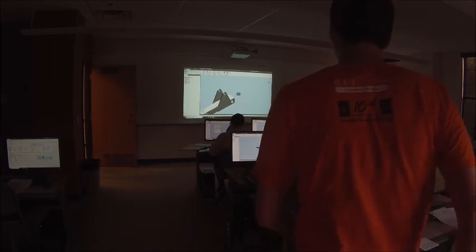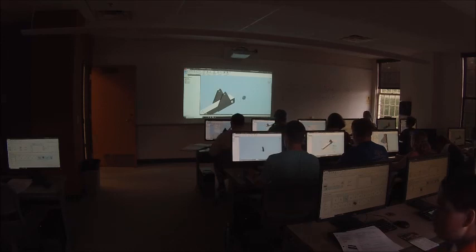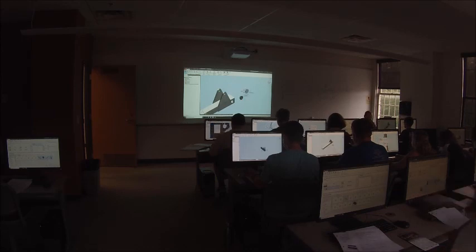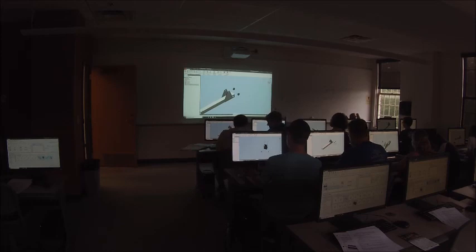All right, so place, go find your bushings. I'm going to delete my sphere because I don't need it. All right, place the bushing. I'm going to rotate once by the Z-axis, and that's facing the right direction for the front bracket. And I'm going to rotate twice by the X-axis to rotate it around 180 degrees so it's facing this way for the other side. That makes sense? So you want your two bushings facing like this. You guys all got that?